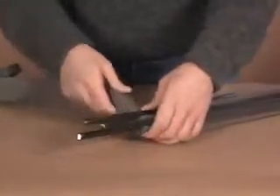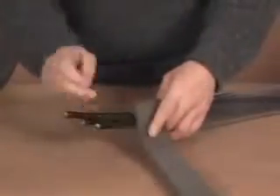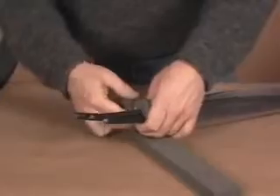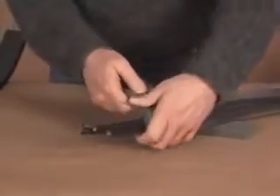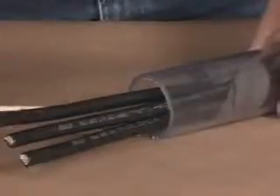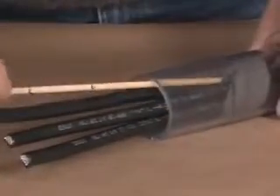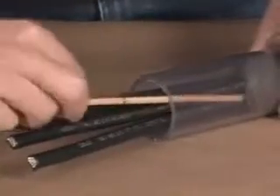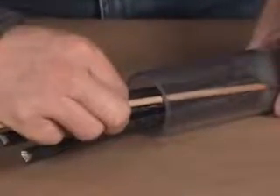Next, create a foam dam by wrapping a foam strip around each cable so that it fills the space between the cables and duct. The foam strip will also slow any existing water flow. Cut the foam to size as necessary. Using the positioning rod, push the foam back into the duct to the five inch or twelve and a half centimeters depth marked earlier, as shown here.